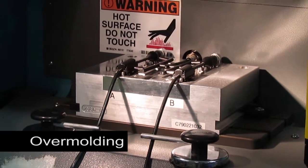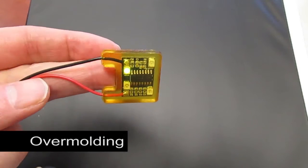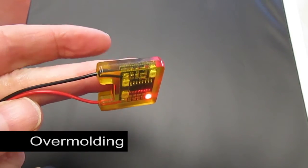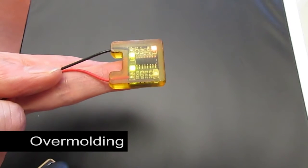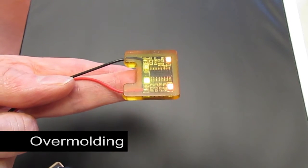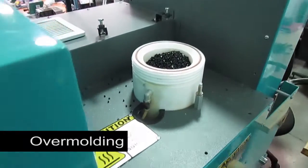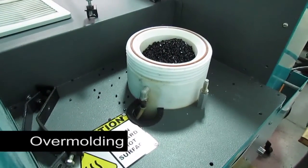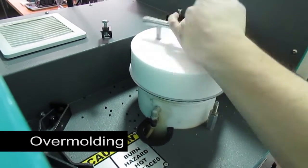You can encase a cable connector or an entire circuit board. It does require an upfront expense for the mold, but it eliminates the per-unit expense of the potting shell, and gives you much greater flexibility to create specialized shapes to fit your product. Molding materials include a low-temperature polyester that withstands alcohol wash for medical applications, and a polyamide that withstands oil and gas for industrial applications.